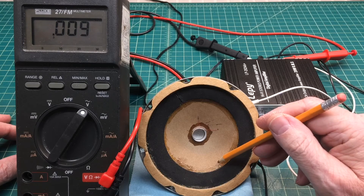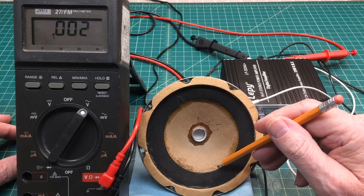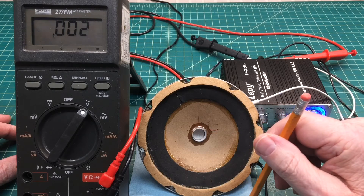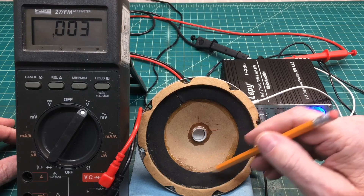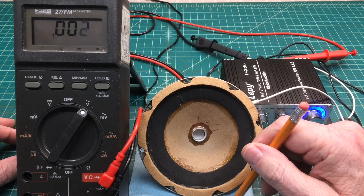The height of the cone itself was not correct for allowing me to do so, and I was putting pressure back on the paper, which was causing the voice coil to be compromised — rubbing against the center pole piece. I knew that because when I put the adhesive on I was generating a signal around 50 Hz or so.